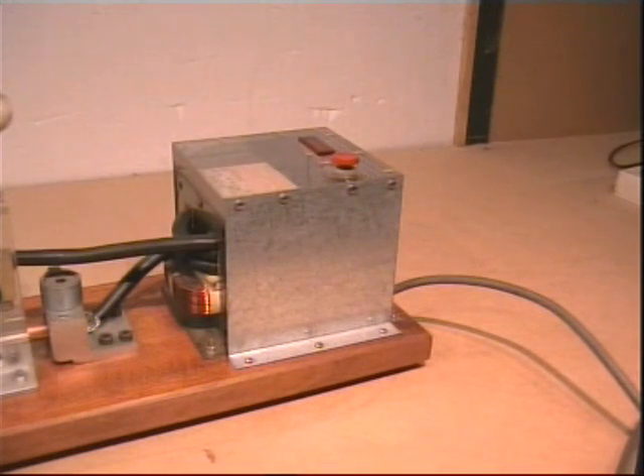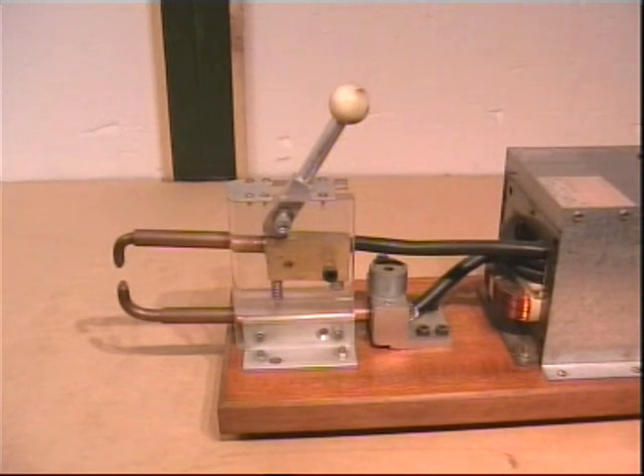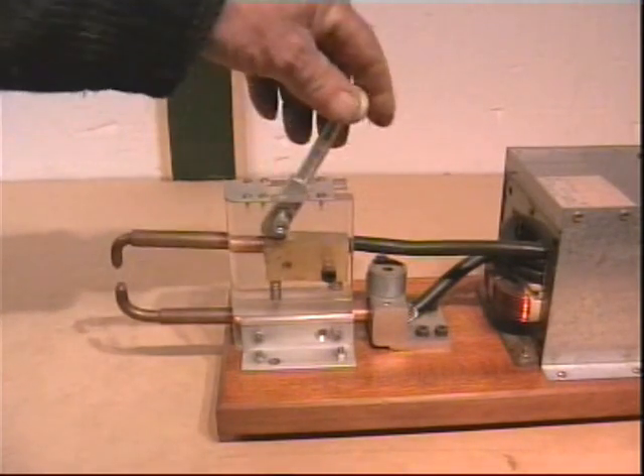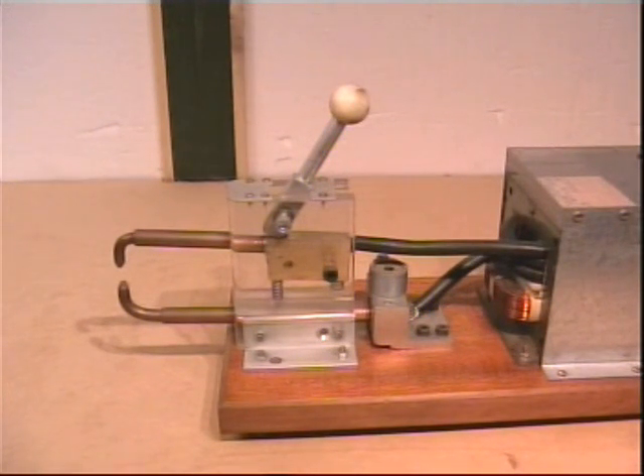The secondary connects to electrodes via two brass blocks. These blocks are drilled out the size of a cable, which is tinned and soldered in order to achieve a good connection. In this instance, one electrode is held stationary, while the second is pivoted by a simple cam device that opens and closes the electrodes. The electrodes are turned or filed to a point, after which a small flat is added. The surface contact area needs to be about an eighth of an inch in diameter.